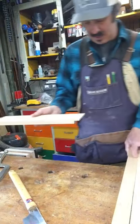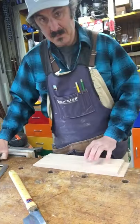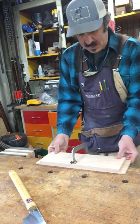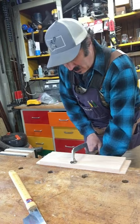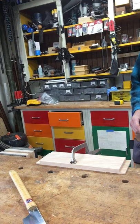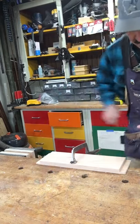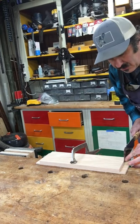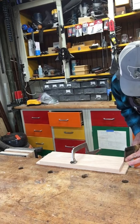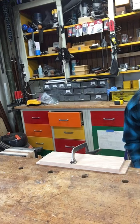I'm going to cut these shoulders by hand and I'll cut the sides of the tenons also by hand. I'm going to lay this out and clamp it to the work table so that it's extending out the side and it's solid on the board there. What that does for me is it gives me the shoulder here as a guideline so that I can hold it against — just how we've done with flush cutting — flush cut that edge there, staying nice and square and even with it. Then I go up until my line.